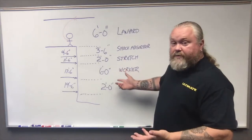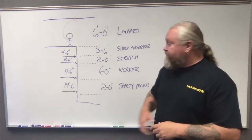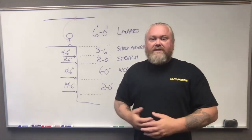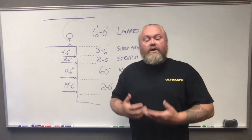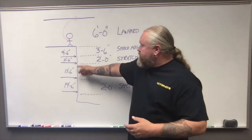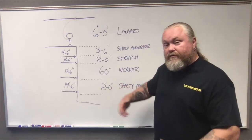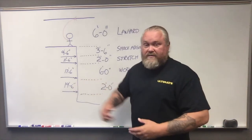The primary person we're trying to protect is you, and we want to make sure that we have enough room for that. The average construction worker is six feet in length, so if you're a little taller, this is going to be a concern — I'm six foot three in my boots, so this becomes an issue. That's why you always want to add on your safety factor. With the addition of the person's height to the 11-foot-6 lanyard and stretch, we get 17 feet 6 inches. Adding an extra two feet for a safety factor, also known as a K factor, gets us to 19 feet 6 inches.